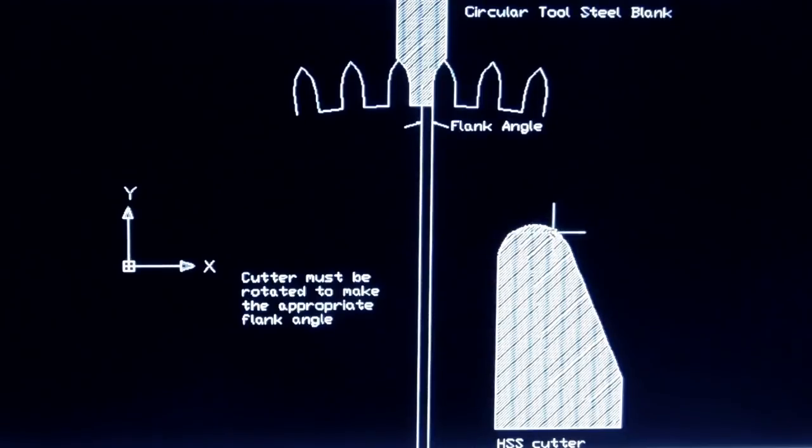There's a piece of one-inch water hardening tool steel — we're going to cut the end of our cutter. So that's all ready to go. We're ready to cut the radius into our cutter blank, but we also need to put in this little angle here. There's an angle between the cutting face and the center line called the flank angle. It's a very small angle, and once again Porter does all the math for you.